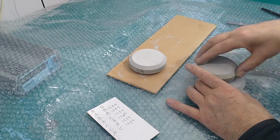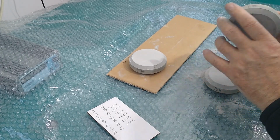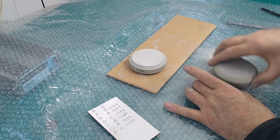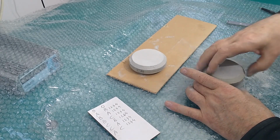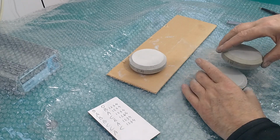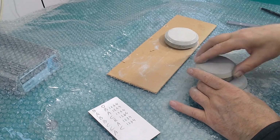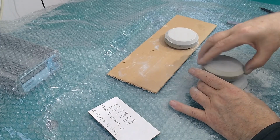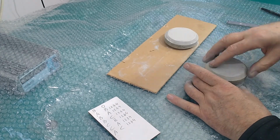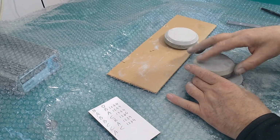In the first round, I roughly ground away some of the largest bumps and holes, which resulted in 2 concave and 1 convex surface. In the second round, I let both concave stones flatten each other. In the third round, I really systematically followed a grinding pattern of rotations and up and down changes. In this round, I repeat the work of the third round, but apply less pressure to the stone and keep to the schedule very carefully. The same number of grinding movements each time, followed by 90 degrees rotations, and once returned at the starting point, a rotation of 45 degrees, after which the entire round was repeated. I also made sure to move the top stone a maximum of 1/3 of its diameter over the edge of the bottom stone.